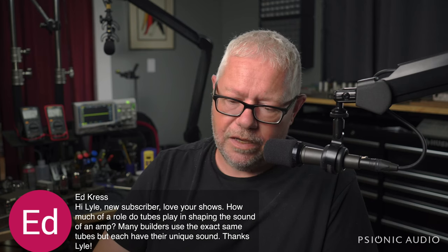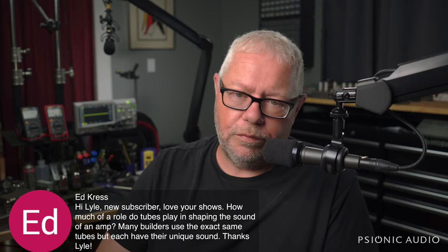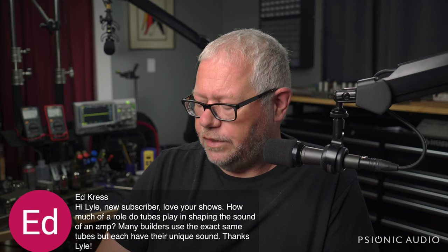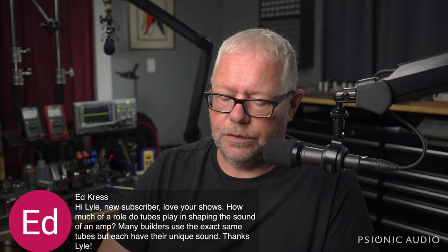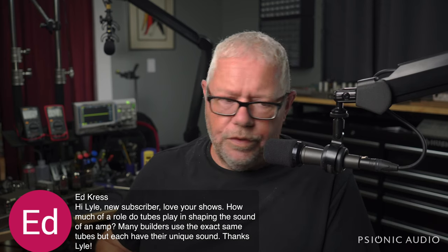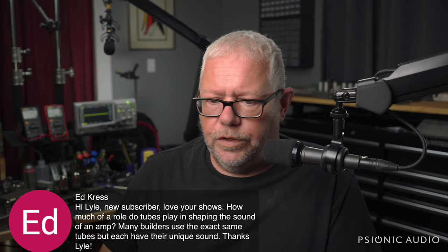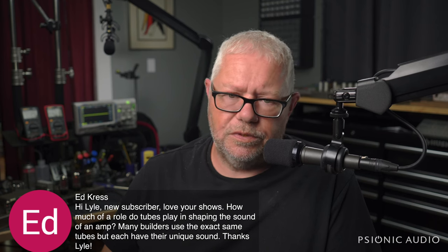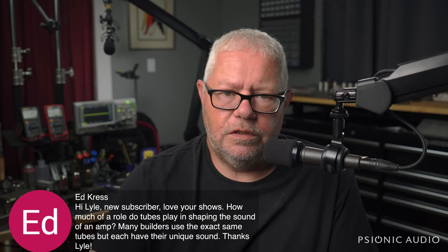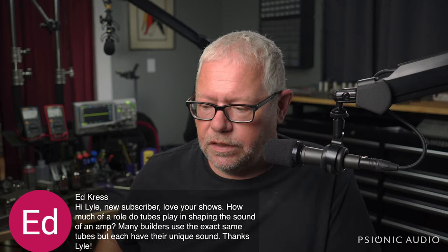In general, I could make an amp with either output tube, and a very small percentage of players could tell which was which. Now there are cases where you might find some really great sounding old Siemens or Amperex or whatever, where the difference can be a little more exaggerated. But Marshall chose EL34s because it was a commonly available tube in the UK that was equivalent in most aspects to a 6L6. Fender never did anything with EL34s because why? That was a British tube. They would have to import them. They could get GE and Sylvania, et cetera, 6L6s.